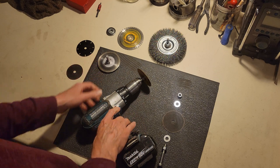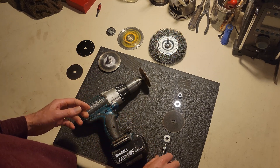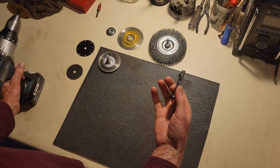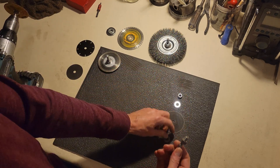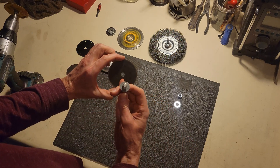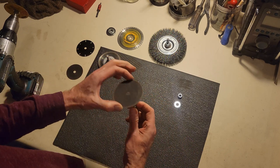This works pretty good, but there's a slightly better way that I just discovered and wanted to share. You'd want to just get a bolt and a nut — get a bolt that matches the arbor hole, that's the little hole in the middle of whatever cutting wheel you want to put on there.